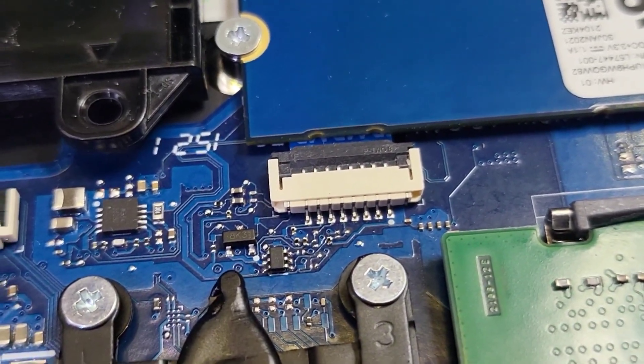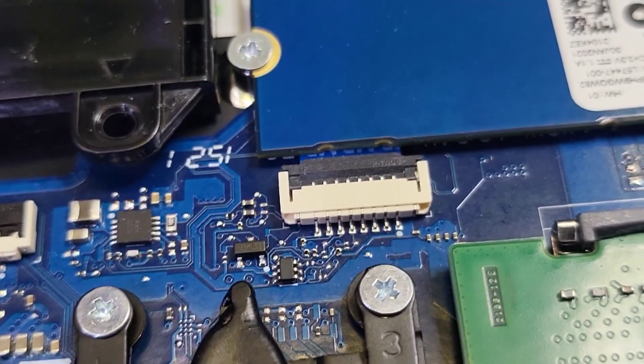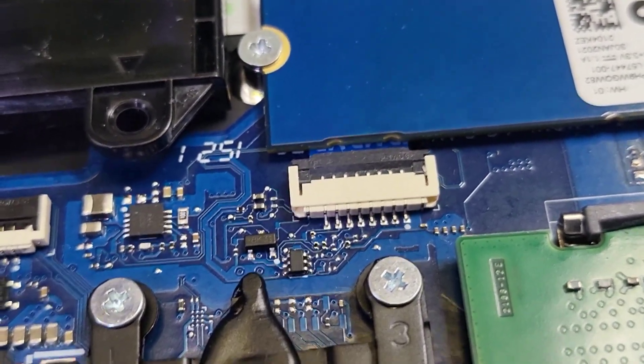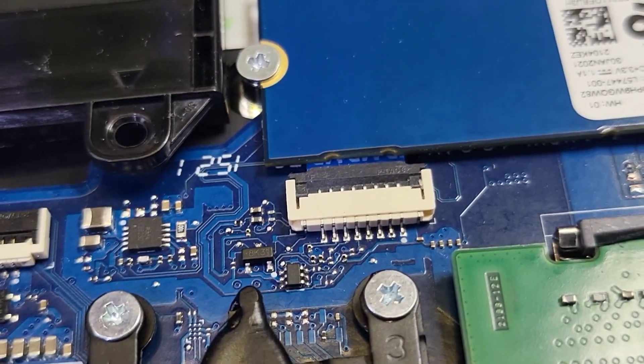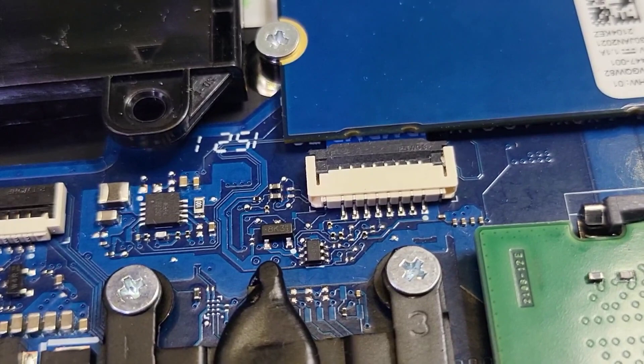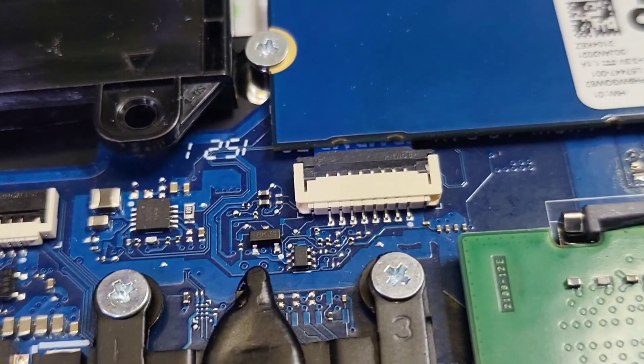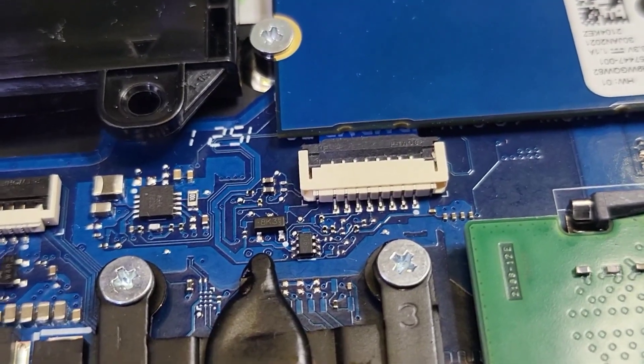Be careful — they're very small. If you apply too much heat you can take them off the board entirely; they're so tiny your soldering iron tip will just take them off. So hold them with a pair of tweezers as you're doing the reflow. I hope this was useful — catch you on the next video, peace.